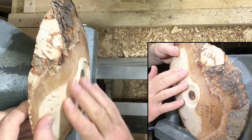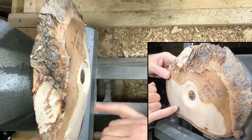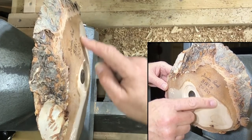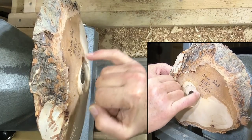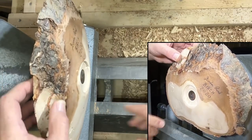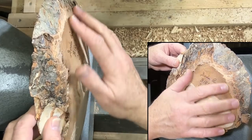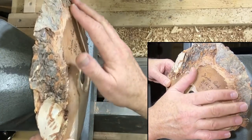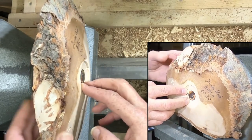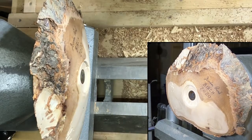I sanded it to 400 grit. I really like the looks of these bug trails all over here. I've got my logo coin in, used pyrography to sign it, identify the species, and put the date on — I almost put 2019 in there. I usually take about 11 months to come around to the right year. I like to see bark after it's soaked with oil — I think it always makes it pop nicely. So I'm going to reverse it now into the chuck, do the top, and then decide what finish to put on.